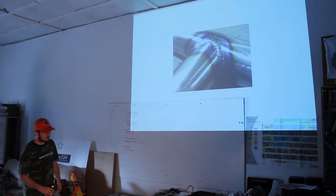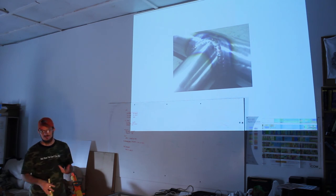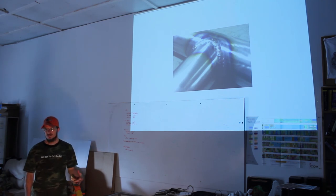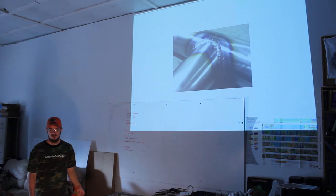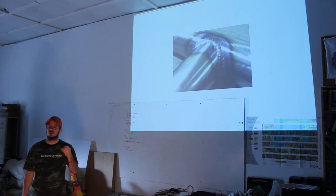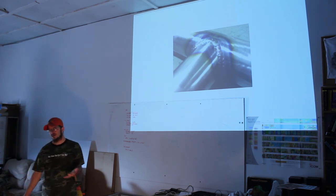There's another whole neat thing I'm into. You'll learn about that during the making your own smelter, aluminum smelter. There's a lot of different materials in the dirt, rock, and cement world. And one of the things that you're looking to attain in this particular discussion is heat resistibility or heat refractory characteristics. And fire clay is used mixed with smaller quantities of sand and so on to make various levels of... it might crack sooner, but it can stand heat better. It might be more brittle, it might take longer to cure, but it can withstand heat better.